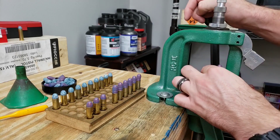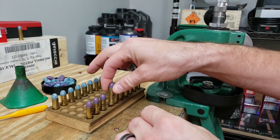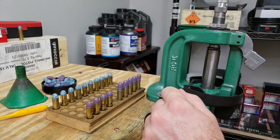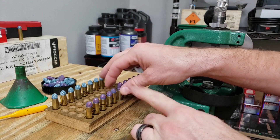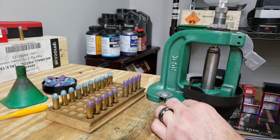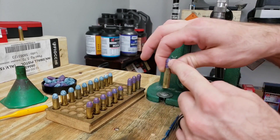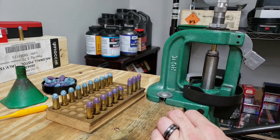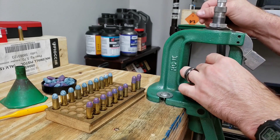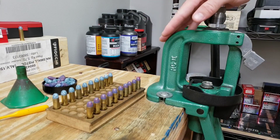I went with dark blue and red for the 16.3 grain rounds — red means hot, just a visual indicator for myself at the range to know which loads I'm using. The 15.7 grain set got white and blue. I also wrote the charge on the case as mentioned previously, so there's no way to mix them up even if I drop them. Even if they fall in water and the marker comes off, I have a visual indicator from the bullet color itself. They are the same bullet, just powder coated in two different batches, cast from the same pot during the same casting session.